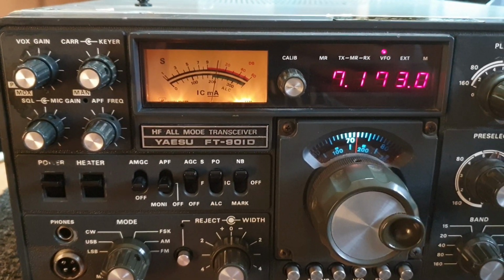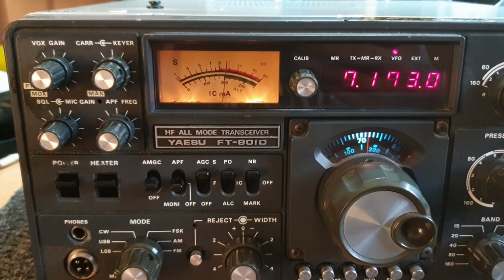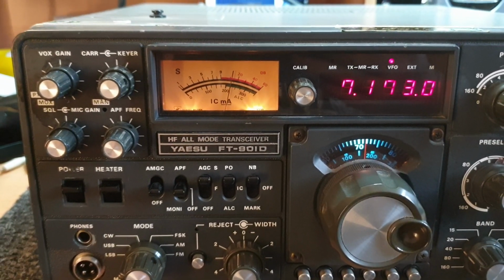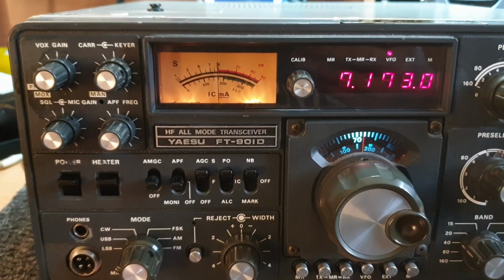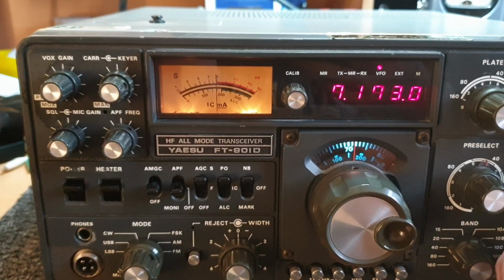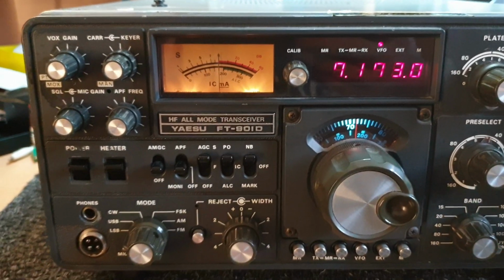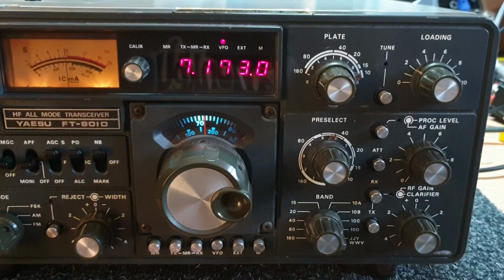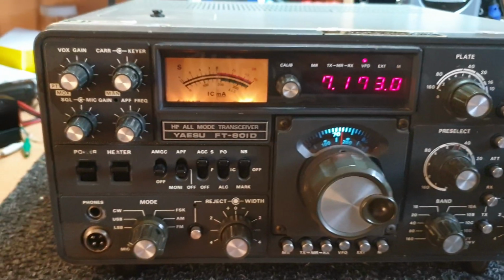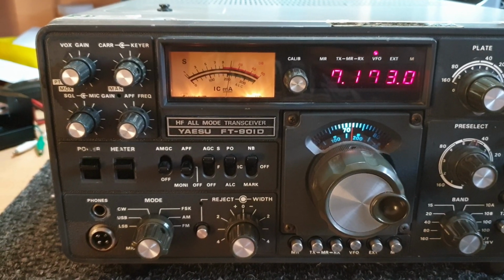INOV, the 40-metre INOV antenna, which we had marvellous fun with. A lot of problems with that the other day, and nothing we couldn't sort out, but it cost us an extra couple of hours, as I can tell you now. Hint to people out there, when buying second-hand antennas, buy a whole new set of clamps, because there's a good chance they're not too good. Anyway, we had to get around that problem when we were a bit remote here.